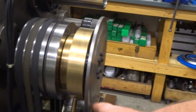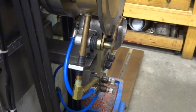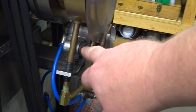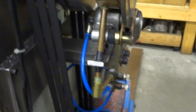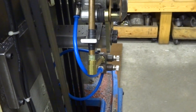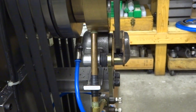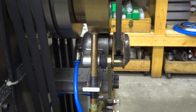I also included a brake — a brake disc and a caliper — because I wasn't going to be able to use the foot brake anymore since every time you use that it shuts the motor off, and I wanted to avoid shutting the motor off. The brake disc I made just from a piece of mild steel. The brake caliper is actually from a Polaris quad — my father-in-law ordered a caliper for his quad and they sent him the wrong one, they wouldn't take it back, so he gave it to me. I was originally going to make some kind of air-over-hydraulic system, but decided to just try it with air first at about 90 pounds pressure, and it works fine — really good actually.